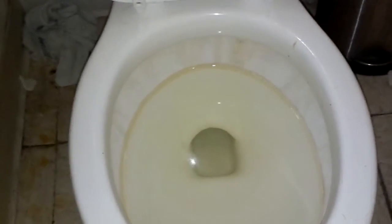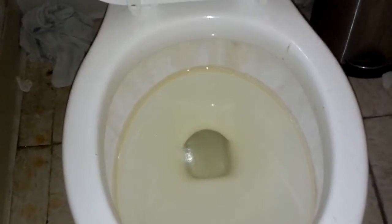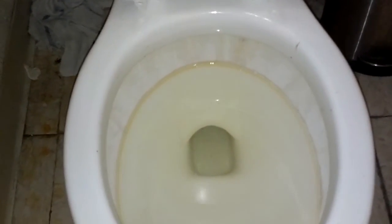And if the ball is leaking, the plunger, the best way to test it is to put some dye in the tank, either some tank cleaner or something that you would use to color eggs. Just put a few drops in there, and if the plunger is leaking, you'll look in the toilet and that color will start filling into the toilet. But there's nothing leaking into the toilet here. It's just this valve leaking.